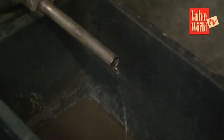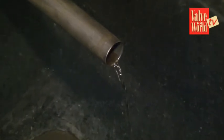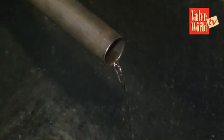After the test is done, we have recorded the added water amount and also collected the water amount of the seat leakage. And to determine what the external leakage is, we deduct the seat leakage from the total amount of added water.